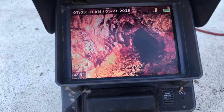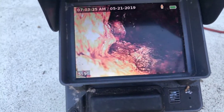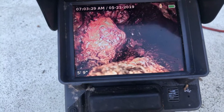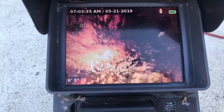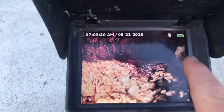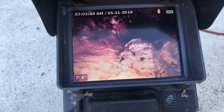It may have cracking in it, but you're not going to see the cracks at this point. You can see how narrow the pipe gets right here, approximately 5 feet up towards that house. We can get a clear view of it where we couldn't the other day when we did the emergency opening of it. It is unclogged, but any time the paper doesn't break into pieces, it's going to lay in there and pile up and you're going to get more and more.